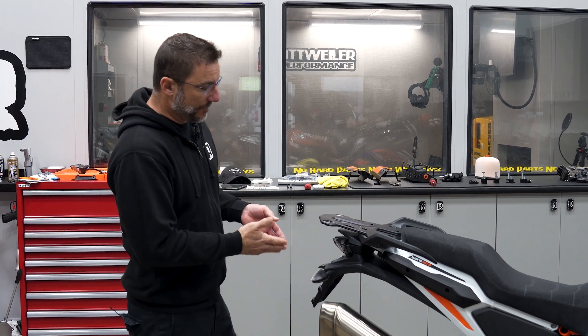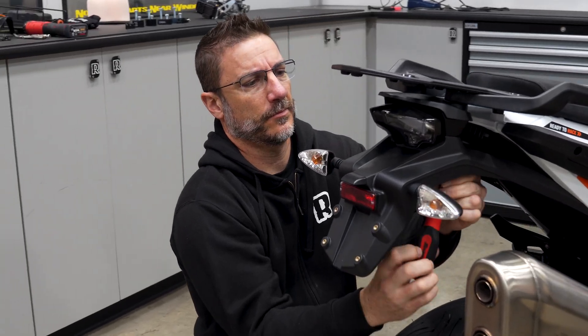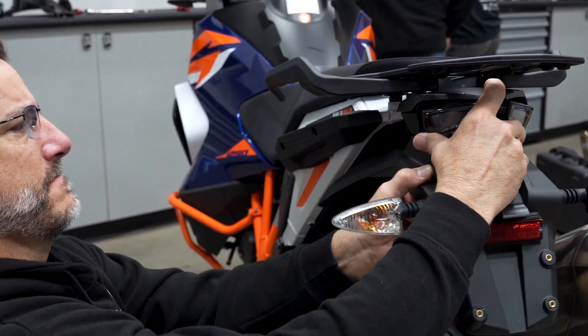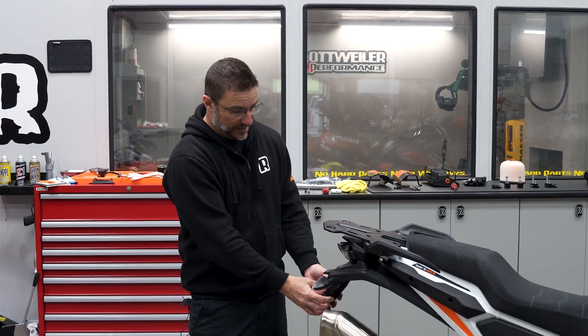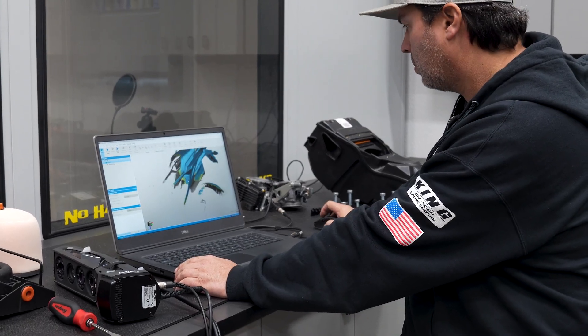Back here is a good way to show how we use the Creaform 3D scanners to design parts. We're disassembling this bike to see exactly how we can possibly make a tail tidy for this bike. The previous models were difficult because the license plate bracket was the entire wheel well — we would have had to ask customers to literally hacksaw a part off, and we didn't want to do that. For this bike we're lucky enough that things bolt together. We've taken a scan of these pieces together, then we're going to remove this license plate bracket and take a scan of the remaining pieces, and we'll be able to create a point cloud and then a subsequent solid off of that so we can design our tail tidy for this model.